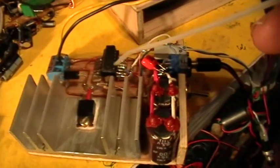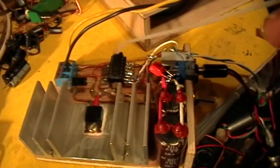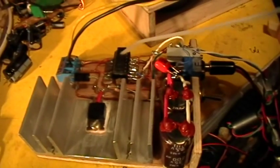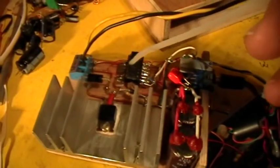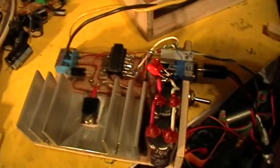Each gate has two inputs. The output of the chip goes low if both inputs are high, and if both inputs are low the output goes high. Both inputs to the chip have to be ANDed and then the result is inverted for the output of each individual gate. It's a Schmitt trigger chip, so it can produce nice clean square pulses even if the input voltages are varying slowly and jittery.